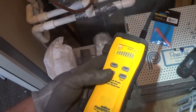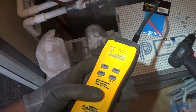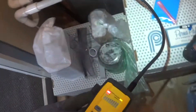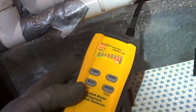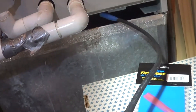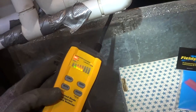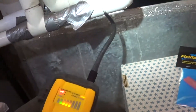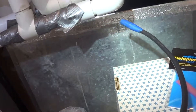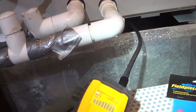When your leak detector starts acting nice, you know your sensor is getting old and needs to be changed, because I have a faint hit in the evaporator, and a two-pound leak per year is actually a really big leak. I would expect it to be setting the leak detector off a lot more than that, but you can see it's pretty repeatable.